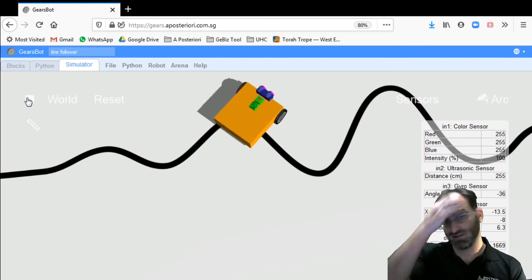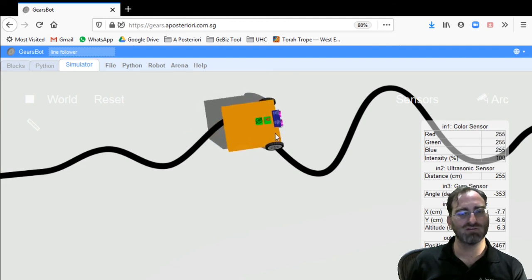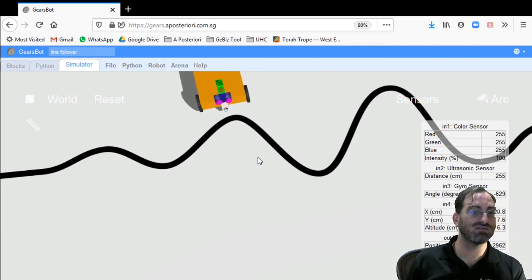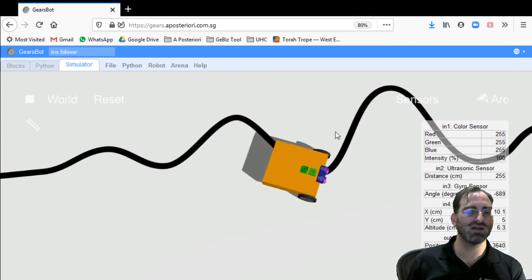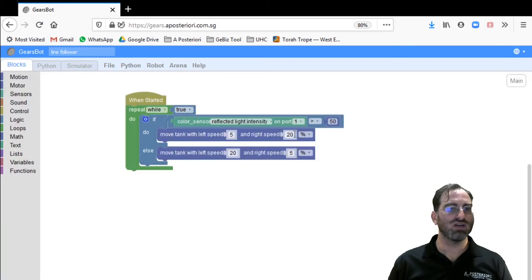And oh, it still has a problem: once there's an inside turn, it wants to turn this way, but by the time it starts to turn, the sensor has already passed and is on this side. Now again, it's trying to, but it's not completely able to. Eventually it might get into a position where by coincidence it can do it, but we call this behavior a failure of this algorithm. Even if it manages to get out of that turn, it's not really doing it in the right way. So even a 4-to-1 ratio between the speeds is still not sufficient to do all the sharp turns.